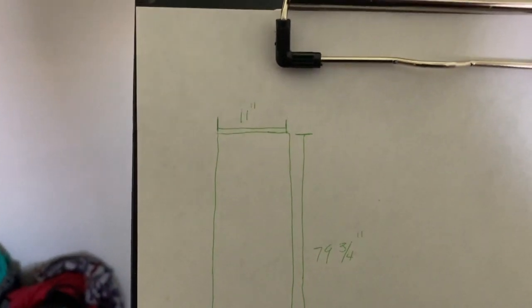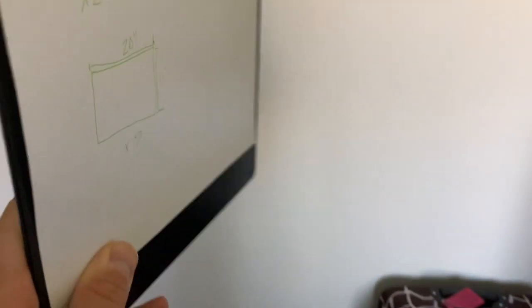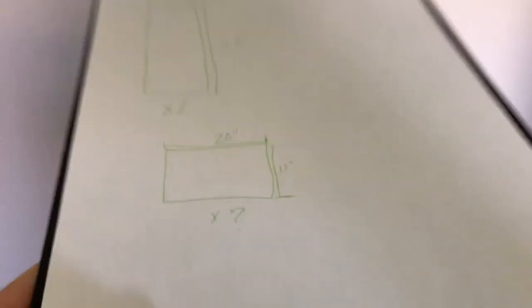I've already measured and taken some dimensions. I have two boards that are going to hang vertical here and here, and in between them I'm going to have these little planks that go flat all the way down — kind of like a shelf in the middle where you can put boots or something. I took a big regular four-by-eight sheet of plywood — close to a half inch thick — and cut it to 79 and three-quarters inches, which is the height I need for the inside of my closet. Then I'm going to cut two strips 11 inches wide out of this sheet for the two side pieces.